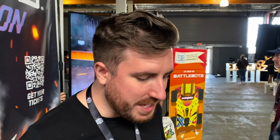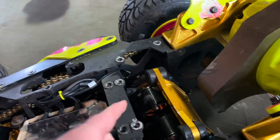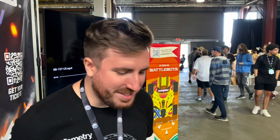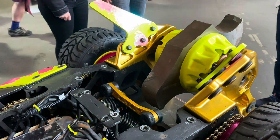And why is everything at an angle? Because it's fun. That was the design prompt: make it as non-boxy as possible. At least on the outside, my goal was to avoid 90-degree angles at all costs. Even this backboard has a bow to it — unnecessary. Your switches are at angles, and that is at an angle too. This is like a Where's Waldo game — is there a single 90-degree angle in your robot? I guess the sides are vertical relative to most of the base plate. The wheels are 90 degrees, the weapon itself is 90 degrees because you need parallel faces for the axle — but only where absolutely necessary, basically where anything spins.